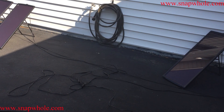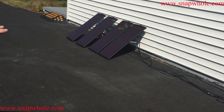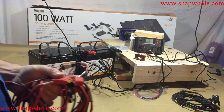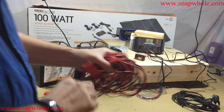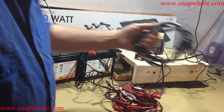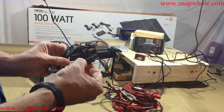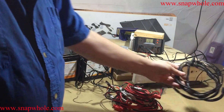That's about the maximum distance you can get between the panels because that's the length of the combiner. Using my extension I got those all the way out in the driveway. I've had it out here for a couple of days and I'm going to leave it for a couple more — I don't want to put them on the roof until I know everything about them. Going through my ham radio gear I found one that actually has a 20-amp fuse built in, and it's probably 10 or 12 feet long. There's also a shorter homemade one with a toroid for RF filtering — it's a 30-amp cable with 12 gauge house wire, maybe six feet. So you have a lot of options and they're relatively cheap.